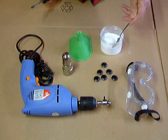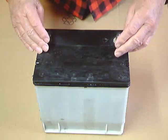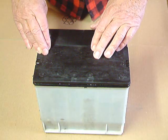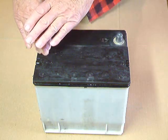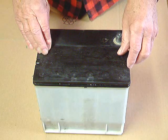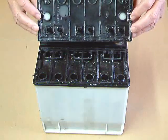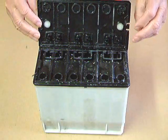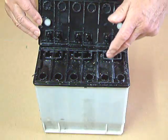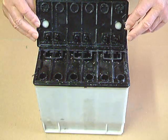You'll notice it's very dry and it's very easy to pour in through the funnel. This is a sealed battery — you can see there are no holes in it for caps. I've removed the label and a cover piece to show you how these batteries work. When the battery is being charged, the moisture comes up and hits the inside of this cover, drips back down and drains back inside the battery again, so the water never gets lost.